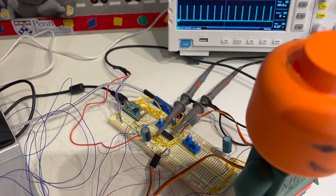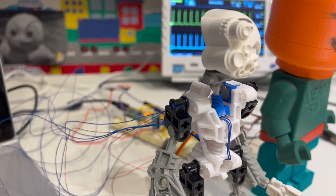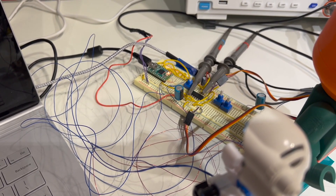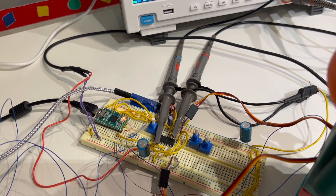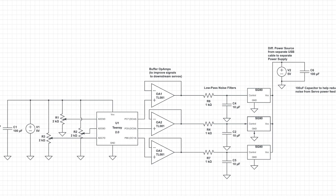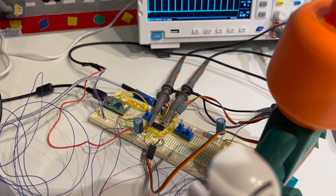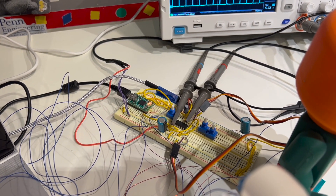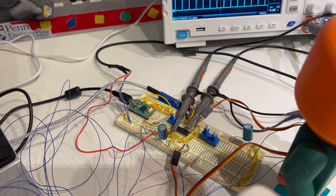The source signal robot uses long unshielded wires — they were literally what I had laying around. Being long and unshielded, they act like antennas and pick up crosstalk and electrical noise. Because of this, I had to introduce a low-pass filter on the servo control signal lines to cut down on high-frequency noise. I also added larger capacitors of around 47 to 100 µF to each power supply — V1 and V2 — for interfacing with the Teensy and servo power rails. Each servo and the Teensy share a common ground to avoid floating ground issues.